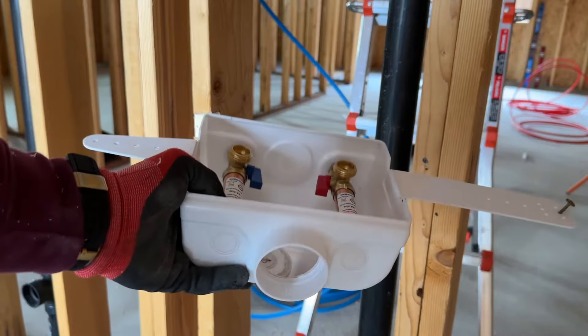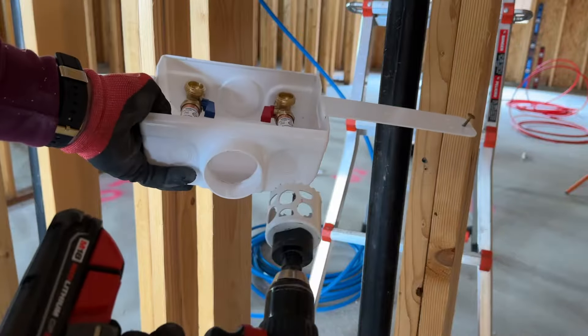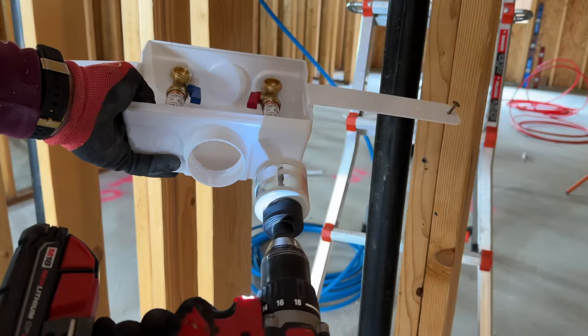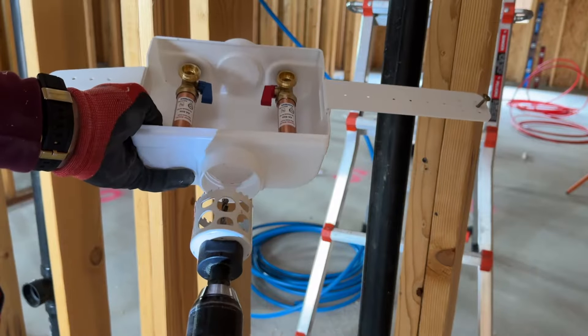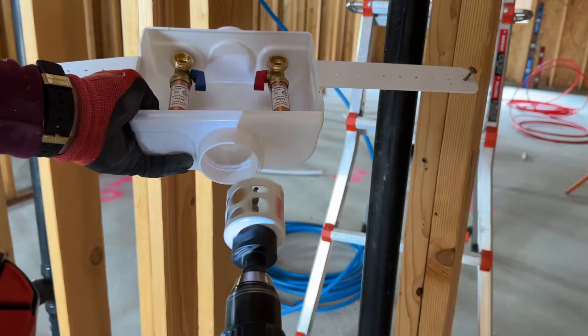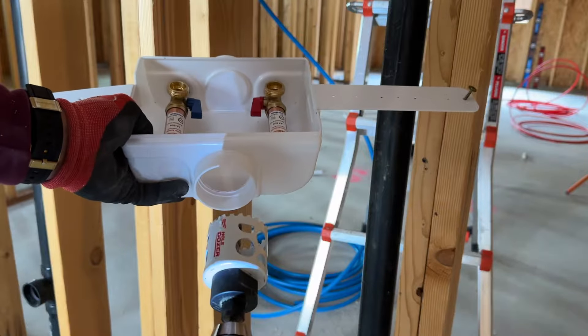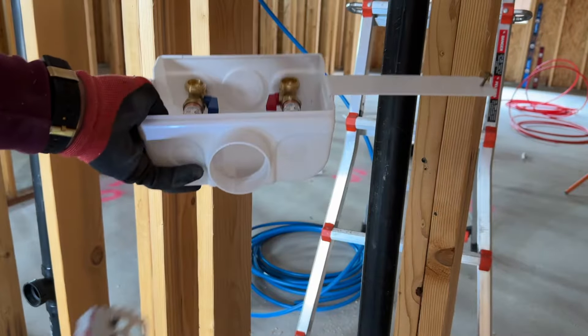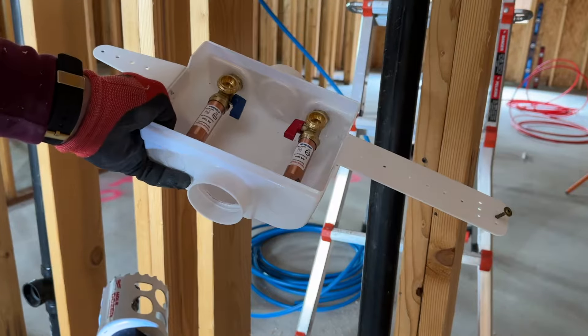In case you're wondering how we take that hole out, I just used one of my hole-cutting bits. The secret is I actually put the drill in reverse, because when you do it the regular way it grabs so hard that it will twist this in your hand. But because this is usually thin, soft plastic, I put the blade in reverse and ran it through, and the blade scraping against it actually cut through it in just a couple seconds. That way you don't cut your hand or twist this thing off and destroy the piece.